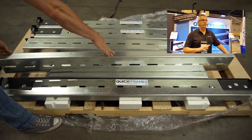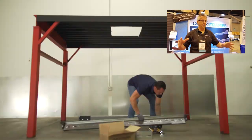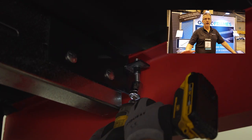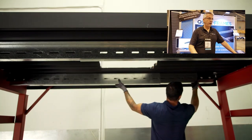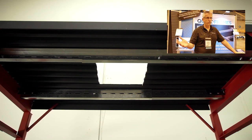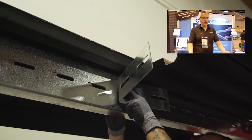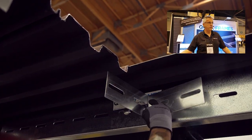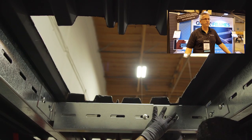So they'll get in, skin a building, but won't make one penetration. The majority of their crew goes away, and later, when all the detail and coordination is figured out — you've actually got the mechanical units purchased from the distributor, the mechanical guy's ready to go — then the erector will come back, mobilize a man lift, come in from the inside, cut their hole, install their framing with Quick Frames, drop the units, and they're gone. Both from the ease of working from the inside and working so much later in the construction process without incurring much additional cost, erectors and fabricators are really taking us on.